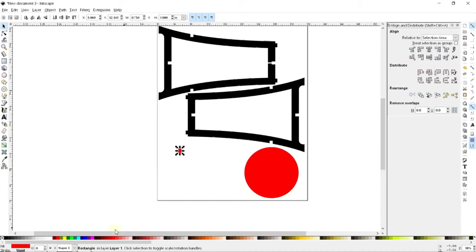And now I'm going to simply copy and paste this. I'm going to use my snapping features to overlap the two rectangles with each other. And now I'm going to offset this down by 9 inches. And presto, there are my two tabs, nice and aligned. And in fact, if I want to be extra special sure, I can confirm that's going to look right, which it does. And so I should be able to align these up with this, which I can't do right now because they are really just two different objects, and so Inkscape won't know where to snap.